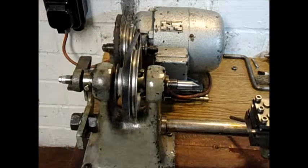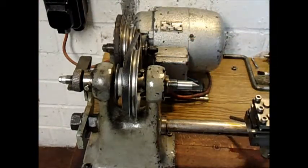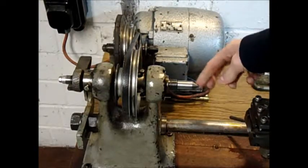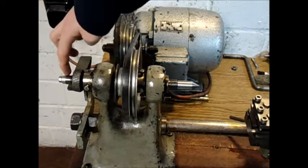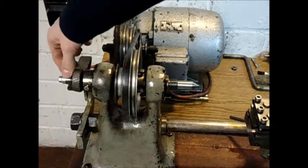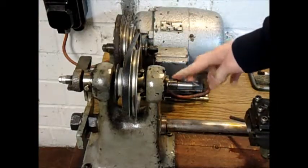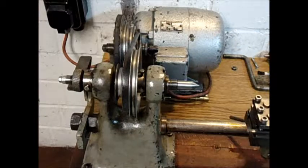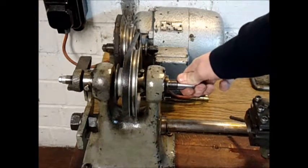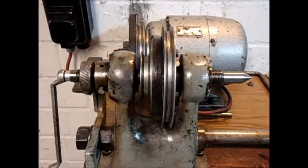Today — I didn't have a camera with me yesterday, so I just decided to finish this piece off. This diameter is now a slip fit inside the spindle bore, and I also machined the 60-degree taper on the other end. You might have noticed I machined a washer out of aluminium so that the screw sits on here without galling the spindle. It actually works quite nicely — the taper sits here nice and accurate. I'll just demonstrate its repeatability and accuracy by taking the center out and putting it back in and checking the runout.